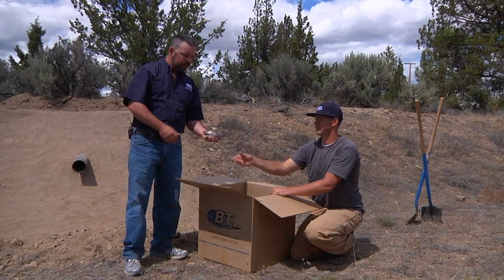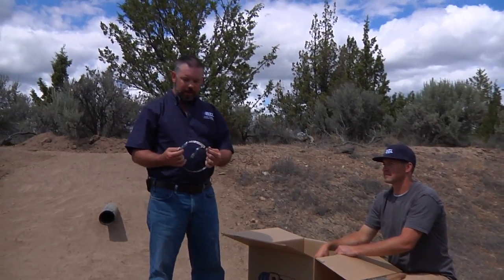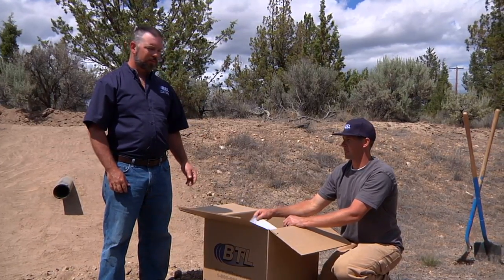Another part of the package is going to be your make-a-clamp that is self-adjustable by a flathead screwdriver. Many of you have seen these. It's a common item in hardware stores. It's designed to go around various thicknesses of pipe, and it's designed to be adjustable so that you can adjust the tension to make sure that you get a secure fit from the boot to the pipe.